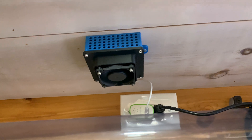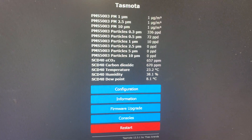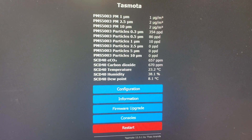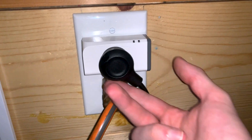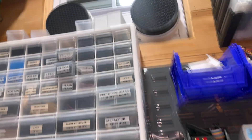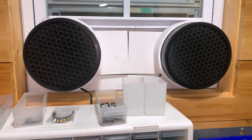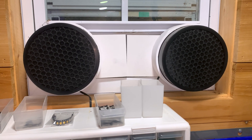The last system is for monitoring and regulating the environment of the workshop — looking at VOCs and also CO2. If it detects levels that are too high, it'll turn on two window-mount fans with HEPA filters that blow air into the workshop to try and improve the air quality.